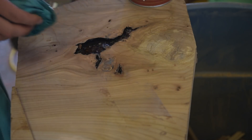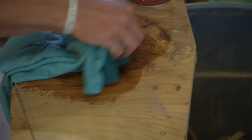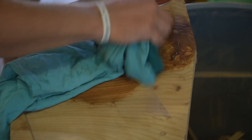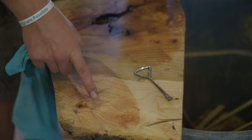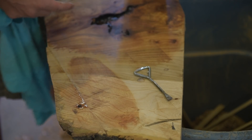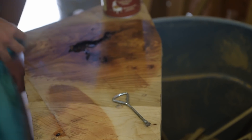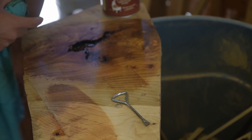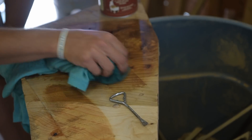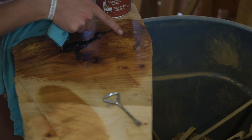Let's try a little splotch here. It seems like the way I did the lacquer it got splotchy really bad, whereas over here this sanded up pretty nice. I was using a 60 grit so that's obviously going to take off the material pretty quickly. I don't see any definite outlines of where the epoxy are — it was like this puddling. I can't see any weird kind of blend. I guess I can see a little bit of the epoxy outline there.